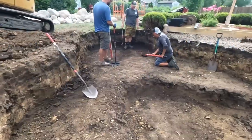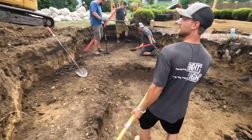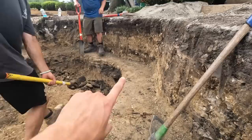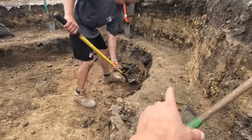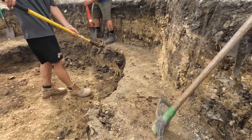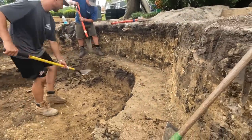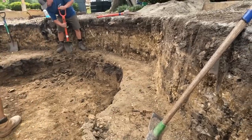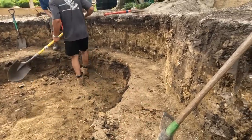We've got everyone digging away while Udi is flattening out our berm on top. We have our pond 99% dug out with just a few areas left. Right now we are over here digging for our wall. Usually you'd see us build a trough inside a liner, but in this case since our wall is going to be above our deepest point — down here at three and a half feet, with this section at two feet — we have to compensate for the one course that's going to be below gravel depth. We're going down five to six inches deep from this point all the way around roughly 12 feet. This accounts for our jet line and base material for the wall, and that gravel mark will be at two feet of water depth.